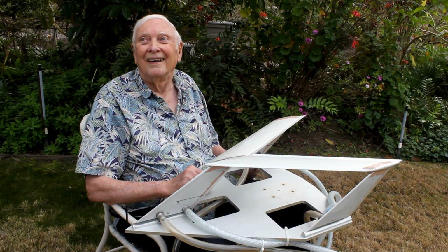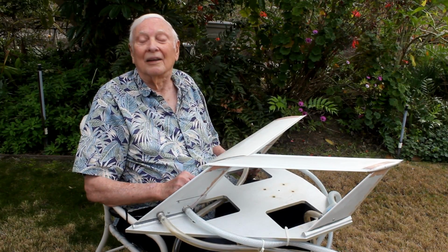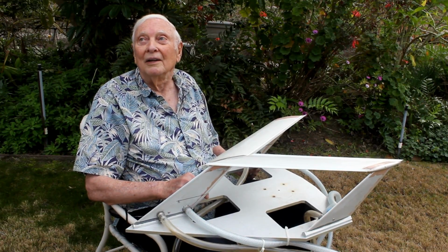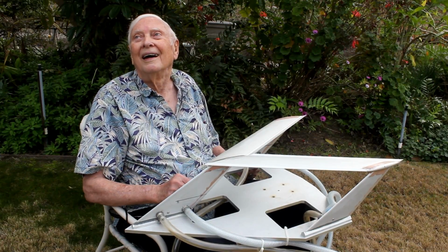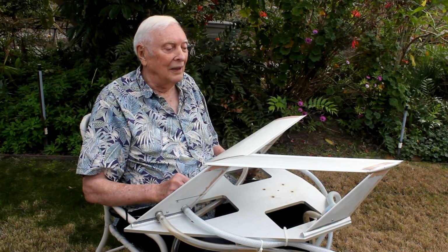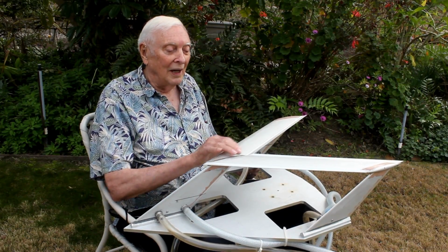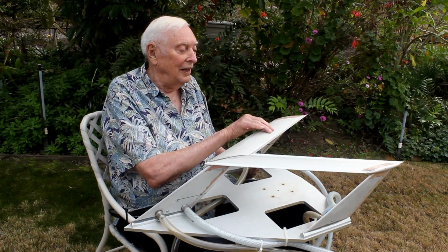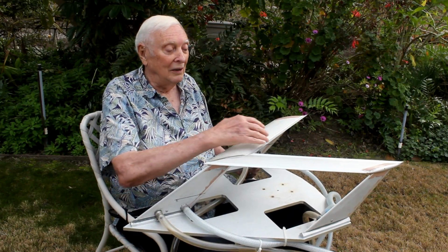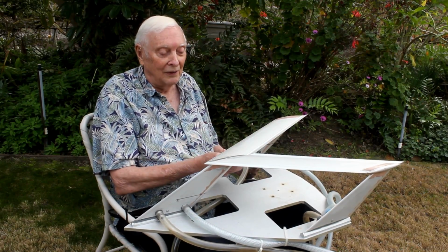And that is a professionally made model. What did you do with that? It was tested in a water tunnel at Caltech. It's a free surface water tunnel, 20 inches wide and 20 feet long. And then what were the results? The results were that we did get significant drag reductions, but not as much as I had hoped, because the air cavity was fine in this region, not so good here, and maybe weighted over here. So the hydrofoil needed to be twisted in such a way that the cavity was uniform on the lower side and also on the upper side.